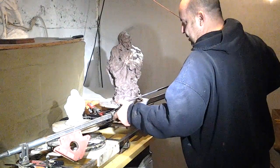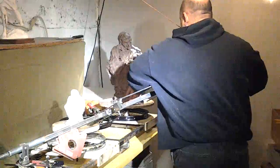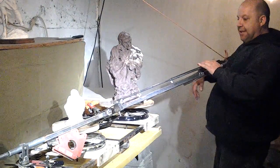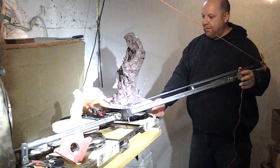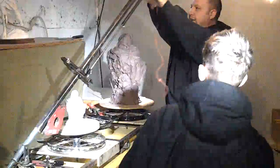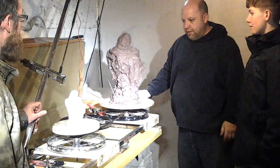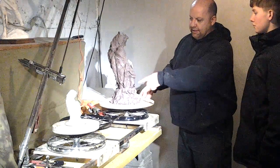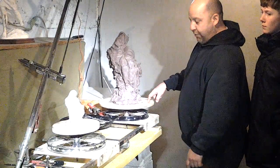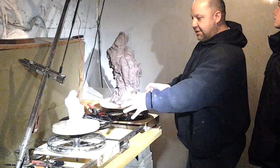When you do that, you reach the point where you're touching the edge of the piece here - I'm right on the edge and it points right to this edge. This could have been down a little bit lower or this table up a little bit higher, and that's what gives us our third dimension. These are anchored on a turntable system where I just use two bicycle back wheels with their sprockets, and one wheel in the middle is a tensioner. The distance between the pivot point and the center point of this axle is the same distance from that end to that, and I can adjust these for scale also.